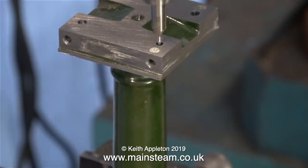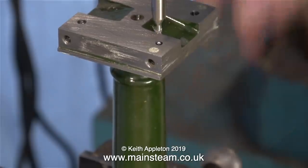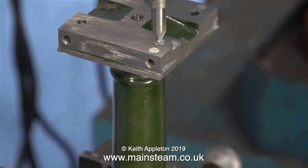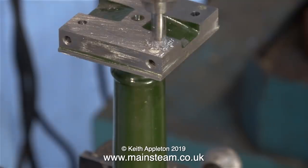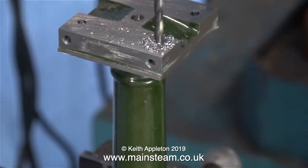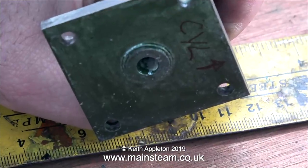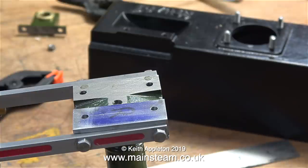Some people will be thinking: why did I machine the top of the column away? Why not just drill the top of the existing column? The reason is I don't want the filler marks to show up — when I put these plates on top it will look much better, and I want to lose every trace of the filler on top of the column. For the last hole I'm using the centre drill again, very slowly but deeply, so that the 5/32nd of an inch twist drill will not wander about.